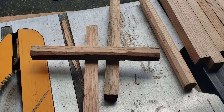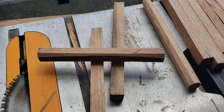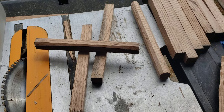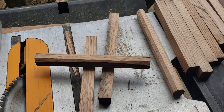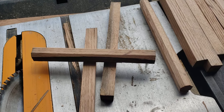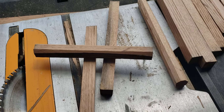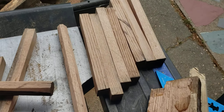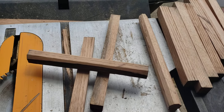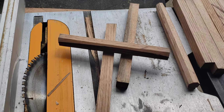I'm going to draw-bore the holes for the joints to help suck them tight. I'm using eight-inch posts and eight-inch beams, and these pegs are about ten and a half inches. I'll probably try to get them about a foot long so I can put a longer taper on them — that way I won't have to fight getting them through, or have them punch out the other side of the mortise on the beams.